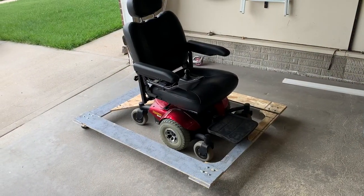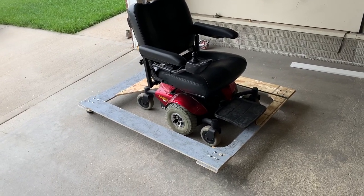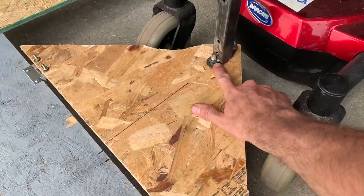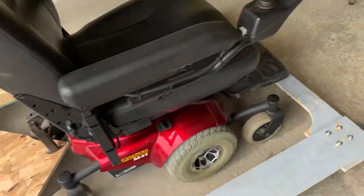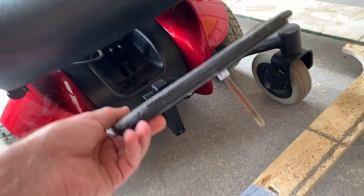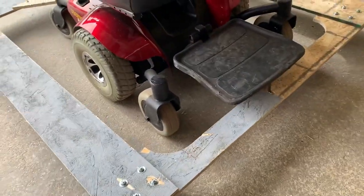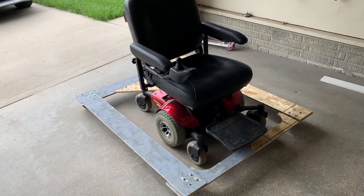Here's our powered wheelchair with the base mounted to it that's going to support the tank. There's a caster under each corner. There's a little hinge here, and up here there's just a shoulder bolt going through a hole — so that allows this to float up and down. On the front, I put a bolt coming down from underneath the foot plate that goes into a hole. That allows this to move up and down so the tank can move with the ground as you go over uneven parts of the street — transitions onto driveways mainly.